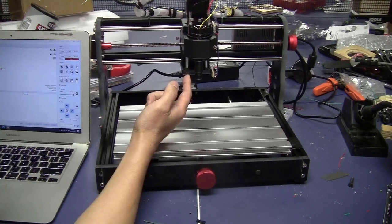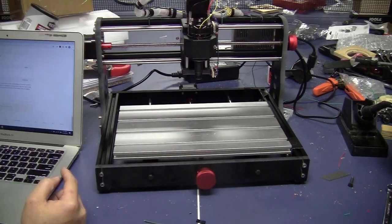The Z-axis moved all the way up. The limit switch clicked. But the stepper motor kept trying to move the Z-axis up and it lost a step. I think that there's some problem here. Let me just do some research to see what's wrong. I found one article on the forum and they said that the problem might come from the interference with the wires. So I should add the noise filter as I told you before.